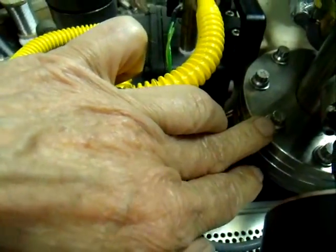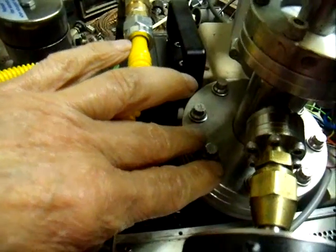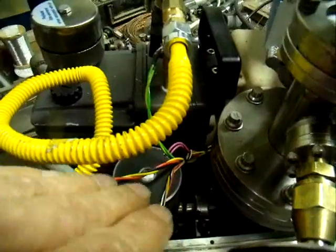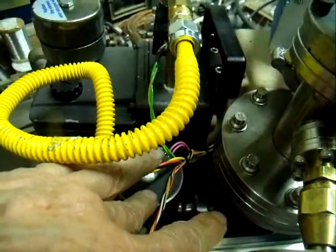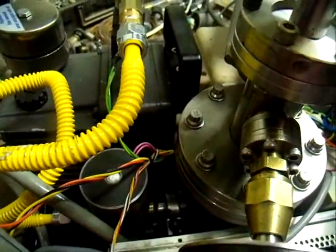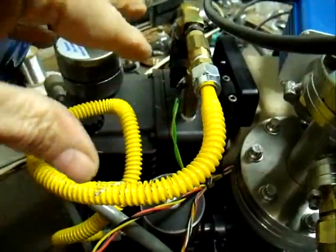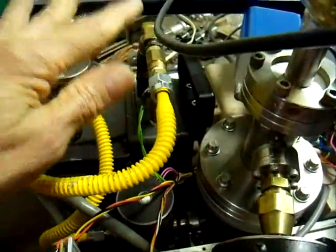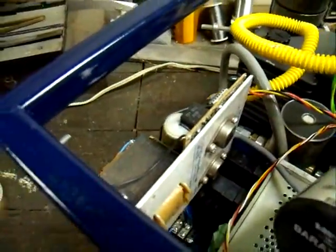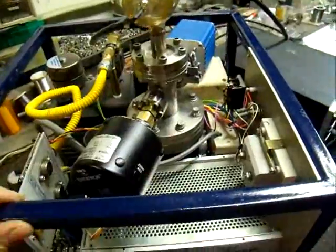The second solenoid closes off the outlet of the turbo pump. This means we can leave the turbo pump under high vacuum at all times — we don't want it sitting at atmospheric pressure day after day, otherwise it takes too long to pump down when we're ready to use it. When we turn the power off, that solenoid drops closed, keeping vacuum present in the turbo pump so everything stays uncontaminated with gas while idle. We have a small power supply — plus and minus 15 volts — to power the gauges. That's all there is to it.